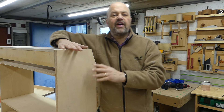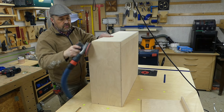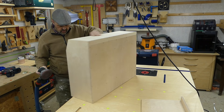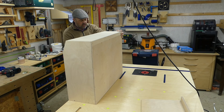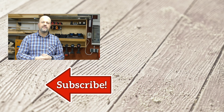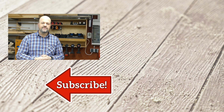So: 120 grit, then the chamfers or round overs, then I assemble, and then I go back with 180 or 240 to apply the final finish. That's done only on the surfaces that are actually accessible and touchable — I don't need to sand the back panel with 180 or 240 because nobody's going to touch it anyway. I think that's a good workflow. I hope you found these tips useful — take care, enjoy your woodworking, and I'll see you in the next video.